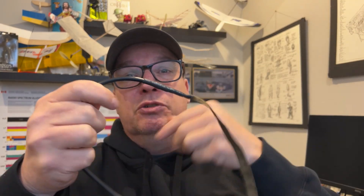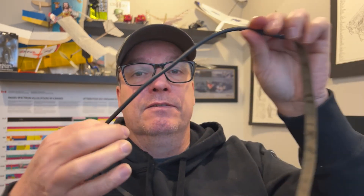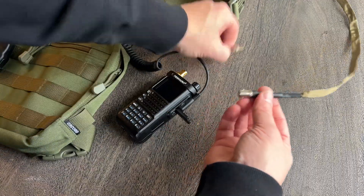There's no reason why you can't actually just do it to the end of a coaxial cable, which I've done here. The reason why I generally don't is that if this coaxial cable gets damaged the whole antenna gets thrown out — the cable, everything. And these can be flaky as all hell. This here is a pretty solid piece. Yes, you can hook it directly to the coaxial cable, but I recommend you do not and hook it right to a BNC connector.